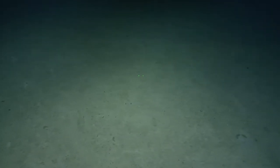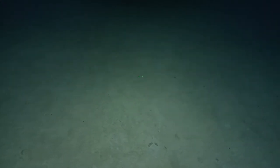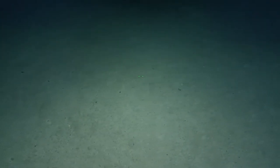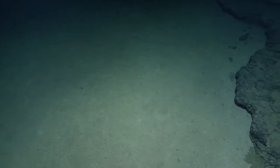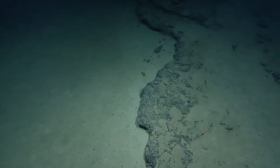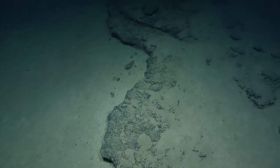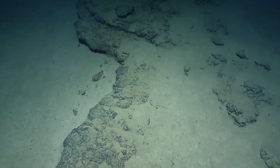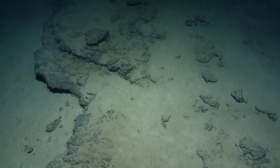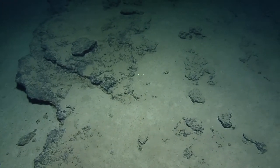With the Blue View it's like 1.2 megahertz, super high frequency — you're only a couple of three meters off the seafloor. The big trade-off there is time. With the Blue View and the Norbit at centimeter-level mapping, you're trying to push the envelope, because at those resolutions you're not limited by your instrumentation so much as by your ability to resolve your position. Your sonar is much more precise than your ability to know where you took the sonar measurement.